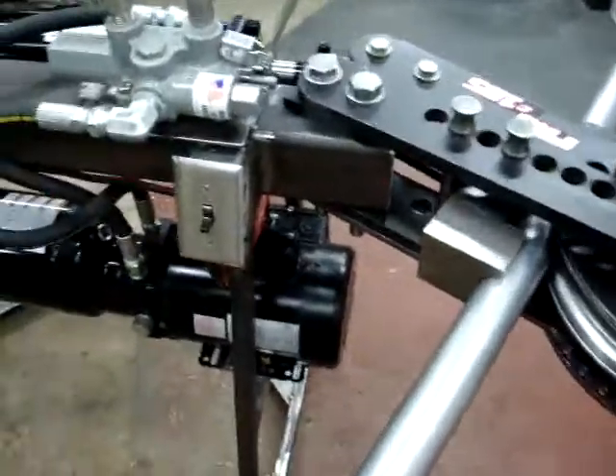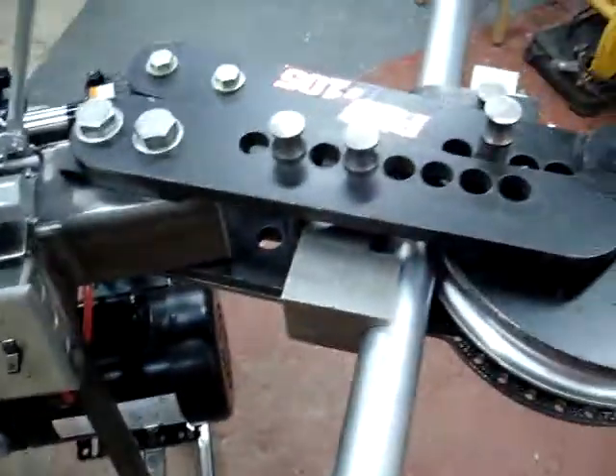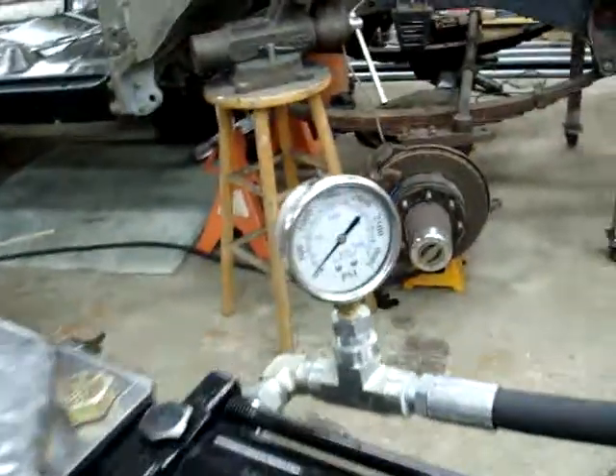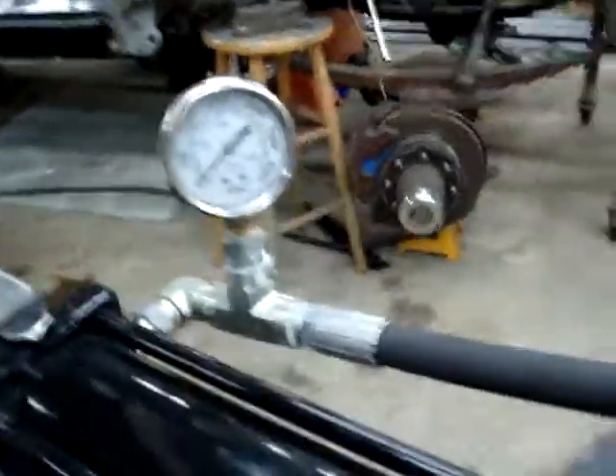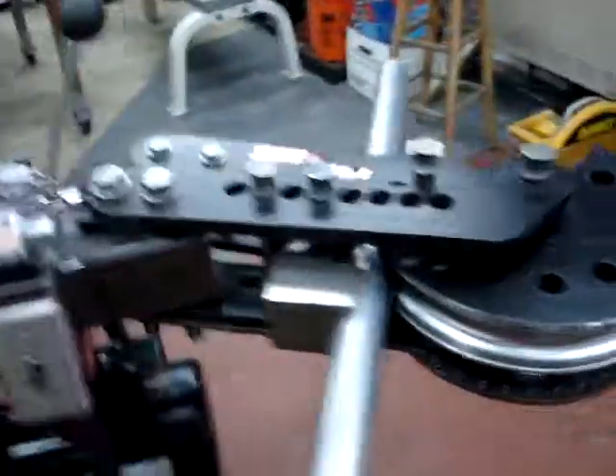When I loaded up the tubing, what I did is I powered up the unit, moved the tube, and rotated the die forward until I got just a little bit of movement on the needle — it's just barely off zero on this gauge — which indicates that it's starting to build pressure in the ram. That basically means that the tube itself right now is snug.